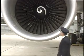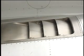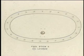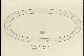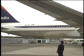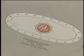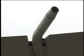Inspect the inlet cowl, fan blades, and spinner for damage or obstruction. Confirm that all ports and vents are clear. Check the leading edge slats — they should be clean and undamaged. Check that the lower wing surface fuel tank access panels are secure and there are no fluid leaks. Make sure all fuel measuring sticks are locked and flush. Inspect the condition of the position and anti-collision strobe lights. Make sure the surge tank vent scoop is clear and the pressure relief valve is flush. Check that the static dischargers are in place. Check that the fuel jettison nozzle is clear and undamaged.